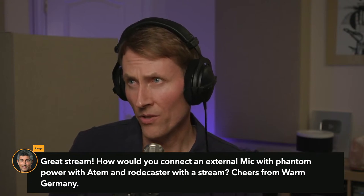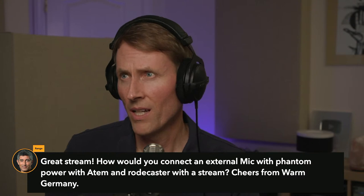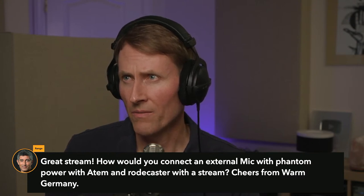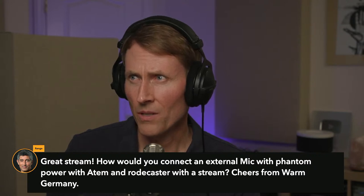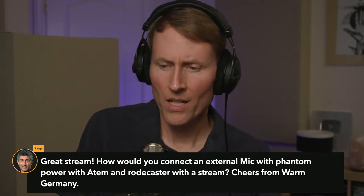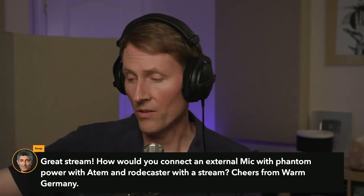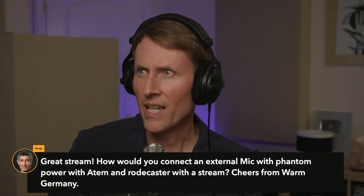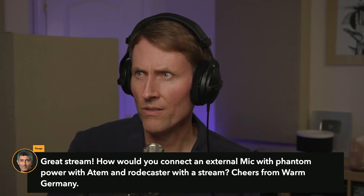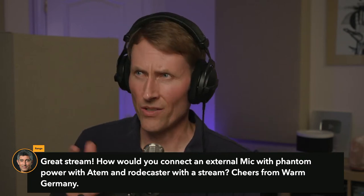In fact, that's one other thing I should mention here. Here's another place where we're adding gain in this signal chain. And I could probably pull it back now. So in the ATEM software control, I've set the gain to 0 on the microphone or line level input that's coming from the RODECaster. You can see I got quieter there. And now let me bump it back up to +6. Now there we are back up on +6. So you can see that's another thing I had to do.